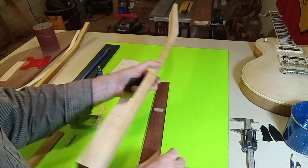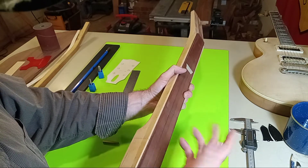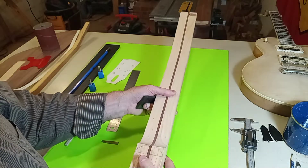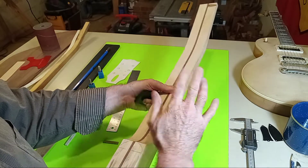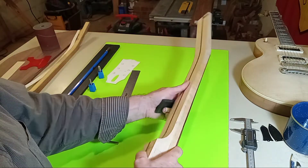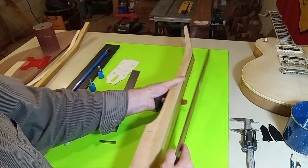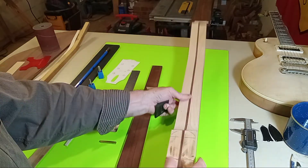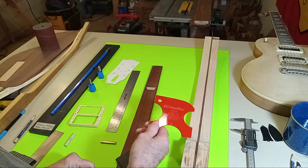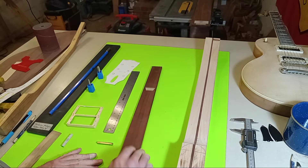You can still make changes later on, even after you build the whole guitar. On the last two Flying V's I built, I was going for the 50s profile target and ended up taking right at a 16th of an inch off after the guitars were already finished — I put them on the jig, cut them down, and shaped them. So don't be afraid to modify after the fact. I'd rather it be too thick than too thin, because we can cut that off after the fact.